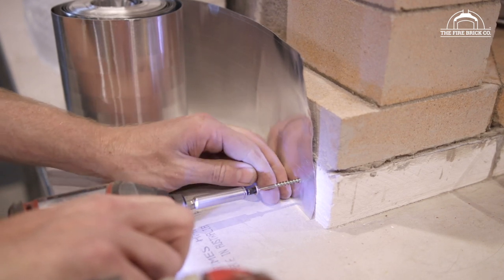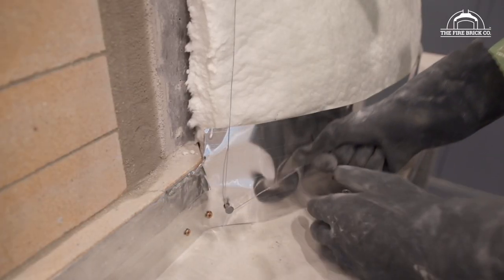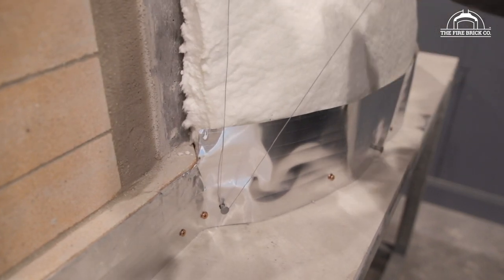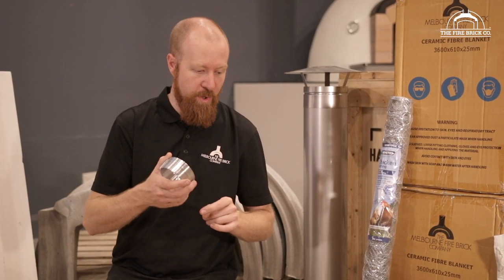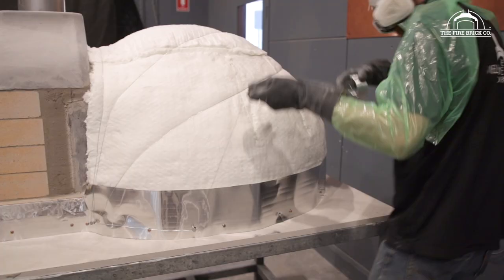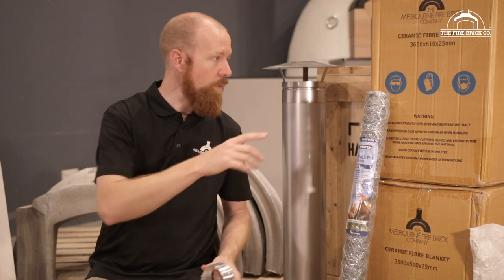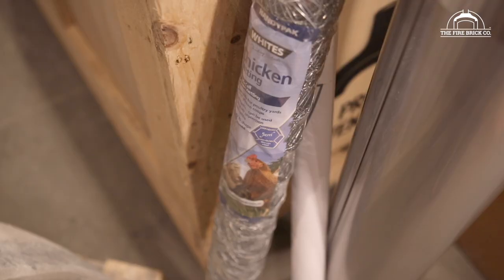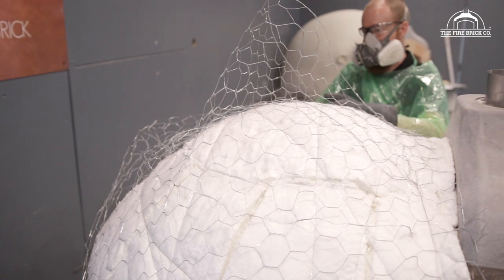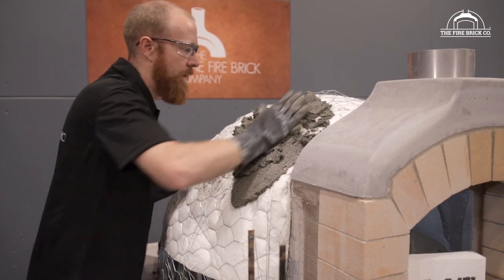You're going to be holding the weather sealing in place with long screws that are provided in your kit, then you'll be installing some large nails. These nails provide hitching points for lashing down the ceramic fiber blanket — we give you a roll of tie wire which you'll loop around the ends of the large nails and run backwards and forwards over the blanket to tie it down. You're then also going to install the chicken wire, which keeps the blanket down against the dome and also acts as reinforcing for the render layer.